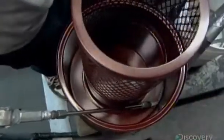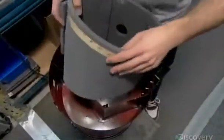They seal the connection between the dirt receptacle and the power unit main body. This must be airtight for 2 reasons: to prevent air from leaking through, which would lessen suction power, and to prevent collected dust from escaping.